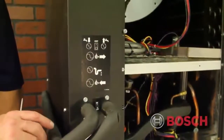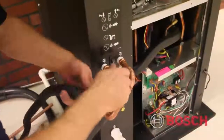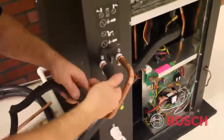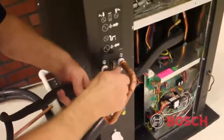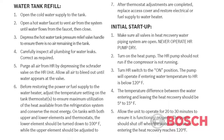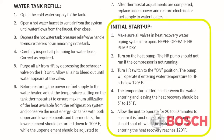All tubing should never be smaller than the diameter of the water connections on the equipment. Please insulate the piping as needed. Upon commissioning, per the installation manual, the water circuit must be void of air — this can be accomplished using the air release valve inside the unit.